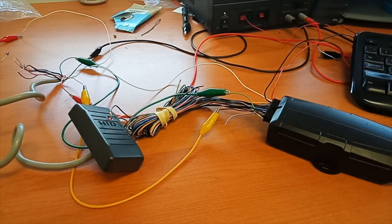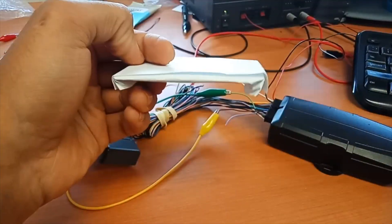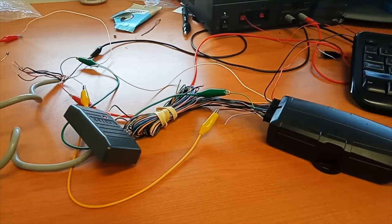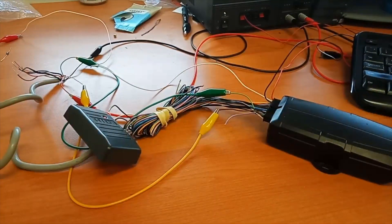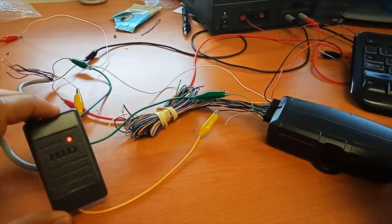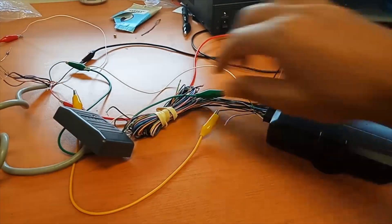As far as some other options go, we can interface on the G120. This is an access card — I've covered it up so I don't show the person's identity — from a work site where there are a lot of different drivers. With around 2,000 staff, having to give every single one of these fobs and manage them when they've already got site cards is a bit of a pain. This is an HID card; all we need is an HID reader which outputs Wiegand. You can Google your card format and Wiegand as the output.